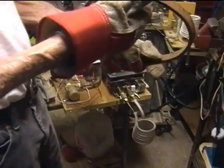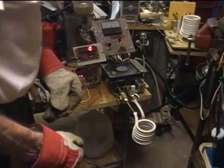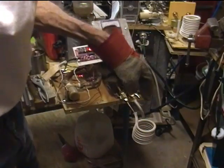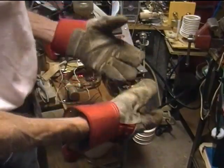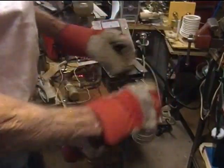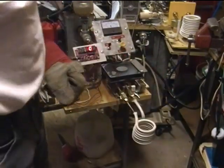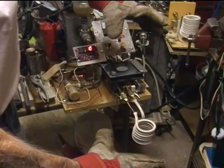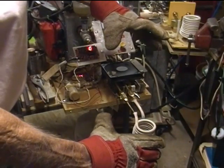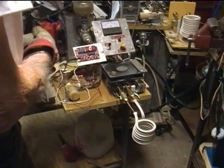Back to about 5 amperes — that really is the end of the test for today. I hope you can see from this test and the previous one that the best way to work things is to have the work fit inside the work coil, which means you may have to make a bigger work coil. I won't say it's never right to have the work piece bigger than the work coil, but from these experiments it's very, very ineffective as we get far away from the work coil itself. And that concludes today's test.